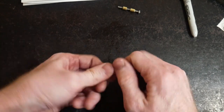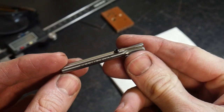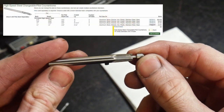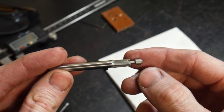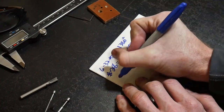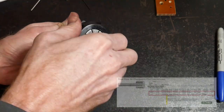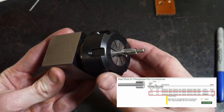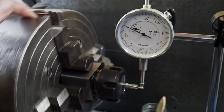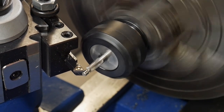Now we're going to cover the counterbore. Both Loveless and Corby fasteners require a counterbore tool so that the head of the fastener can sit into your handle scales. I found a counterbore at McMaster-Carr that has interchangeable pilots. A Corby fastener requires around a 3/16-inch pilot while a Loveless fastener requires a 140-thousandth pilot hole. Having an interchangeable pilot means you can use the same counterbore for both types of fasteners. Along with the 3/16-inch pilot for Corby fasteners, I also purchased a 5/32nds pilot that I am going to take 15 thousandths off of, making it the perfect size for a number 28 hole.